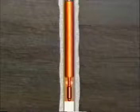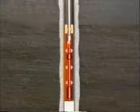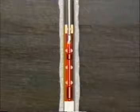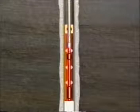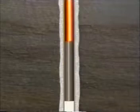The trip saver is run in place of the top bushing of the wash pipe. It provides a mandrel on which an overshot can be placed inside the wash pipe. After washover is completed, the well is circulated clean. The mandrel with the overshot is released from the wash pipe top and lowered until the overshot latches to the gravel pack assembly, ensuring efficient one-trip retrieval.